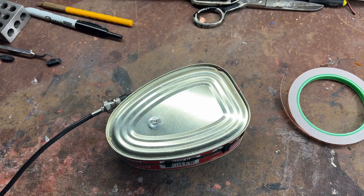A can of ham, strangely enough after measuring it, is about 350 millimeters around the circumference of the outside. If we're going to do a slot antenna, do you know what 350 times 2 is? 700 — 70 centimeters. I'm willing to bet that this is going to resonate fairly well with just a little jumper and I turn it into a slot antenna.